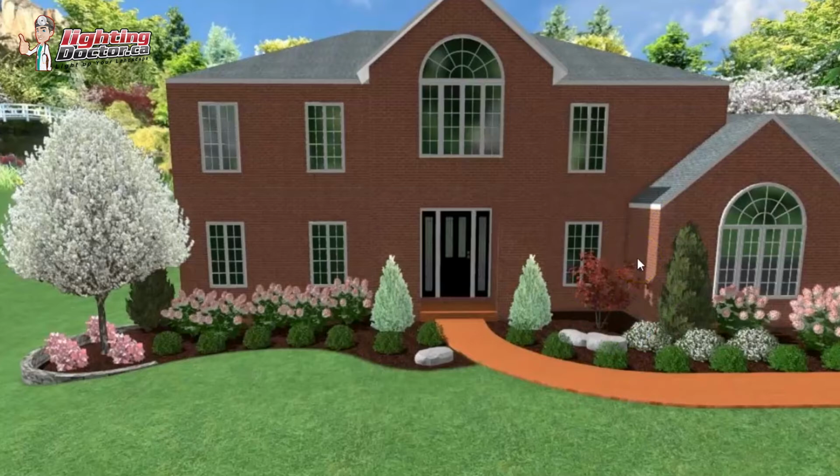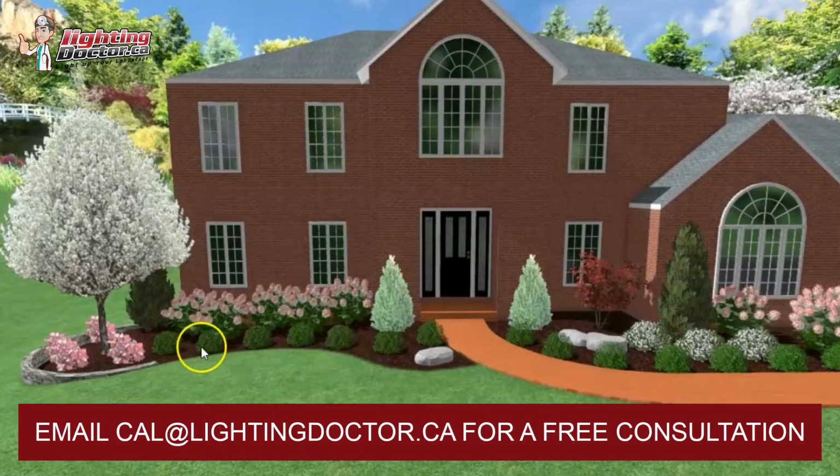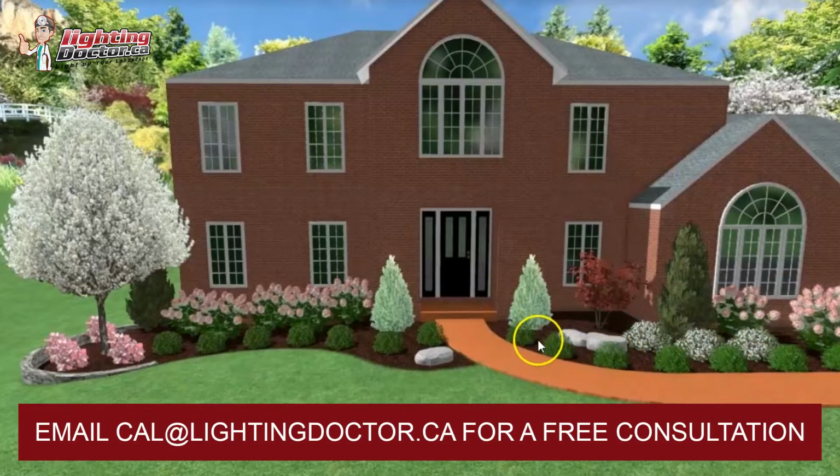And then to create a matching effect and have a nice lower level of lighting, rather than what I see a lot of people do, which is just put in path and garden lights, which in your garden I think would actually still look really nice if you did maybe 3 of them in between these shrubs, and same thing over here. But a light I like to use is that wash light. If I've got my 2 uplights here, I might throw a wash light behind this bush, highlighting the nice roses here. And then over on this side where I've got the house lit in the front here, I might throw a wash light to highlight some of these roses. And even if you do that, you can still sprinkle a couple of path and garden lights if you want to highlight the pathway, but you can use them very sparingly.